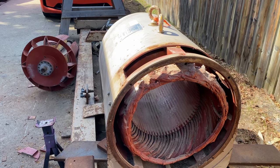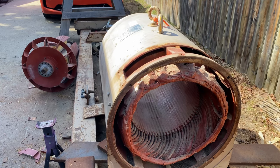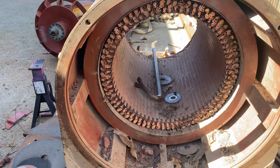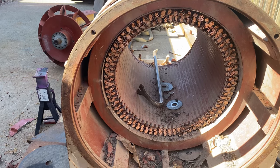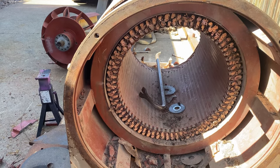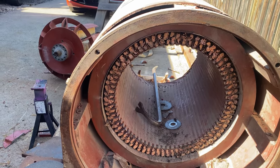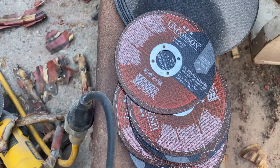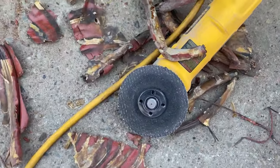We're going to cut that ring off and I'm going to do that off camera, because nobody wants to see me do that for an hour. So we got the crown off. It's funny - I was using the Canadian Tire Mastercraft blades and the first half took me five hours and 14 blades. The second half, I bought Lincolson blades from Amazon and it took 45 minutes and half a blade to do the other side. These are what the blades look like, and this is how much of the blade I have left.